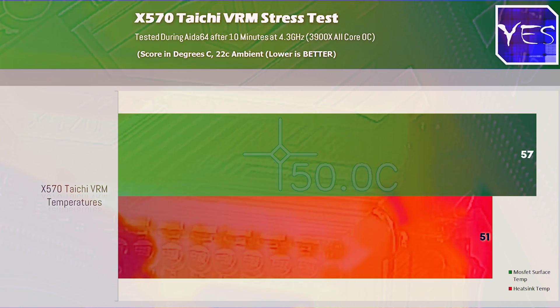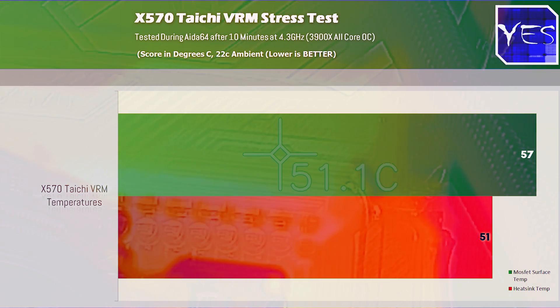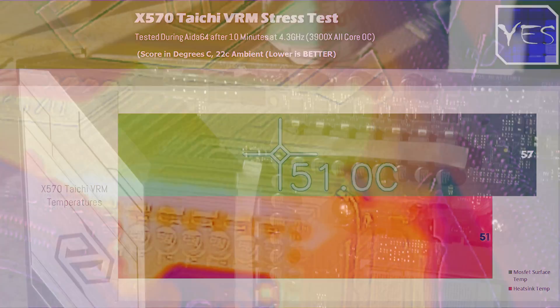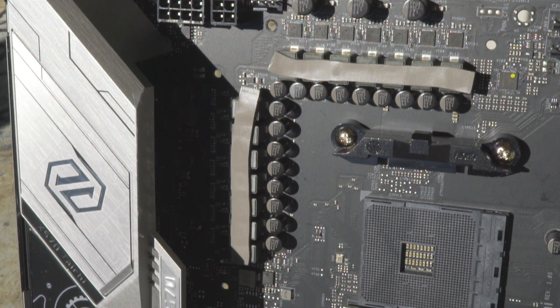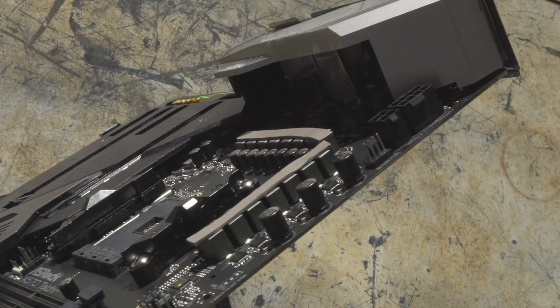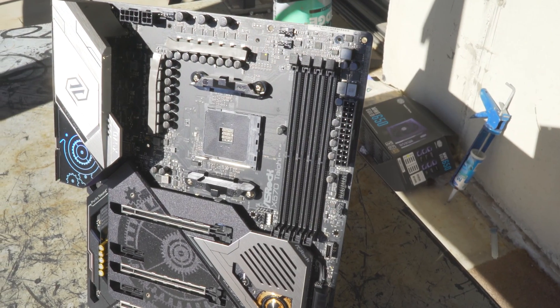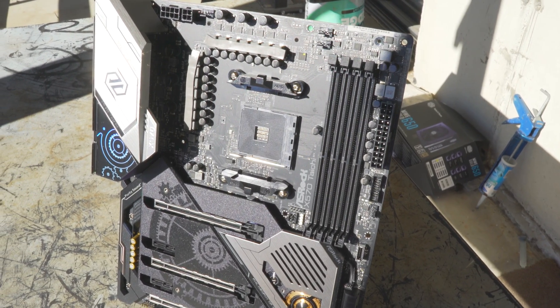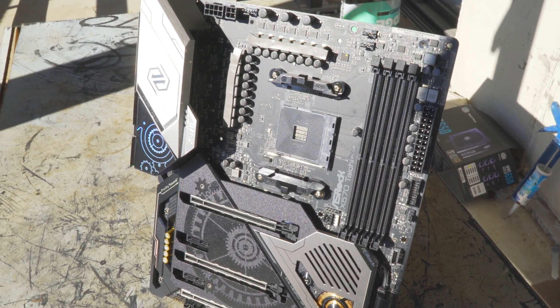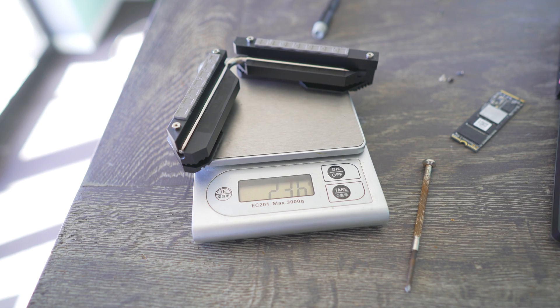So this thing is running very cool, and you won't have to worry about active cooling on this VRM either. Of course, it will be geared up to the 3950X when that 16-core solution is released. They also require the CPU power pin layout with eight plus four pin. Overall, a very solid VRM implementation from ASRock, and the heatsink covering those chips weighs in at roughly 236 grams.